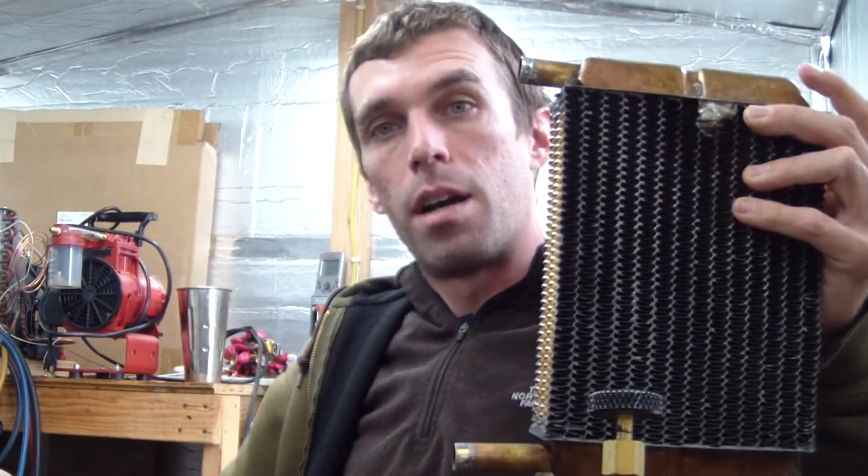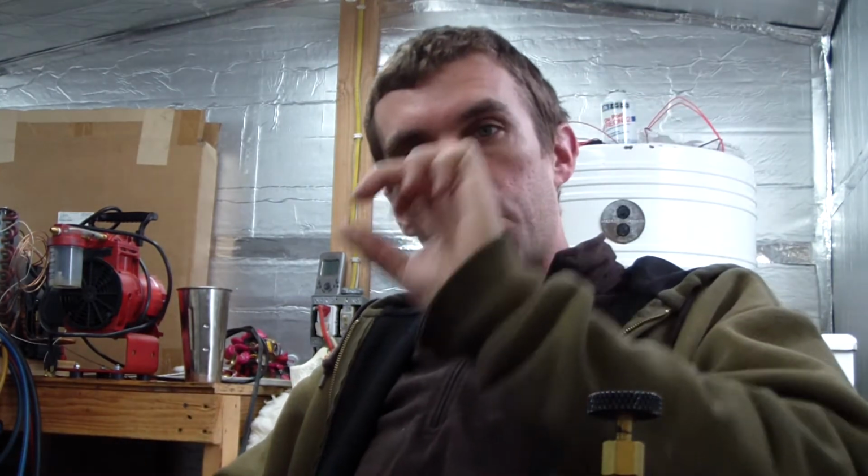In all the testing that I did under infrared, and you can look at some of the videos to see what I'm talking about, I was only utilizing maybe the top third of the condenser for real condensation, and the rest would have been some degree of subcooling, whereby some of that liquid was held up. The reason I think it was held up is that at certain times you would see the warm area of the condenser shrink slightly, and then suddenly grow. In many cases that would be preceded by one or two of the channels getting very warm, and you could literally see where the liquid was dropping and vapor was being condensed there, releasing a lot more heat. So maybe it's not an ideal choice as a condenser, but frankly, I haven't seen a design out there that is ideal for this small application.